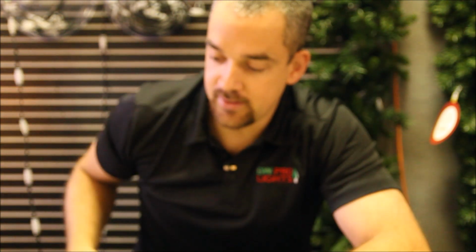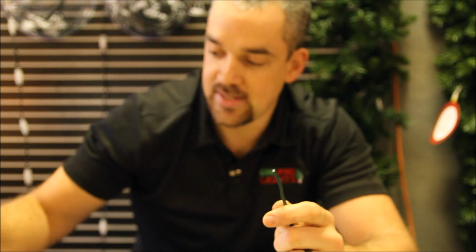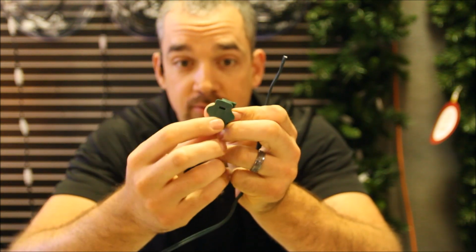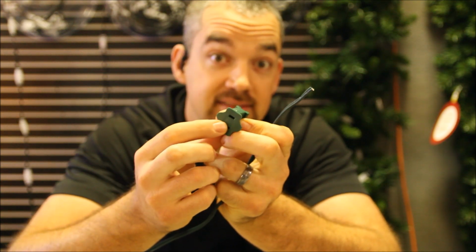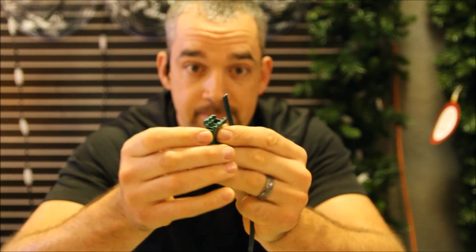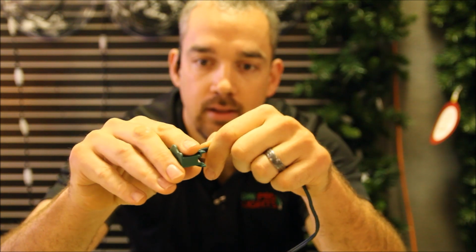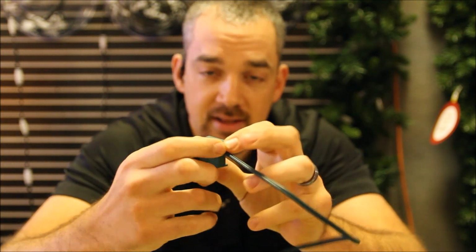Now let's go for the end of the cord. So here's the other end, and I will take the end female plug and do the same thing. This right here is the wide slot. This is the narrow slot, so the wide slot is negative. So I've got my ribbed side there. There's my vampire tooth. It's going to be on the left hand side. And so I will just slide that right in. And then take my wedge and slide that on. There it is. So that's connected.